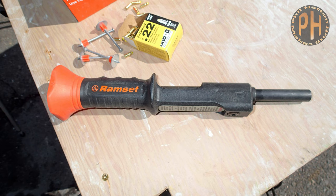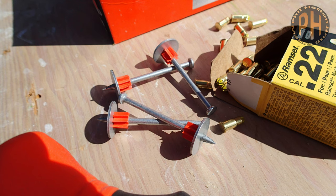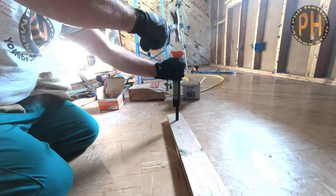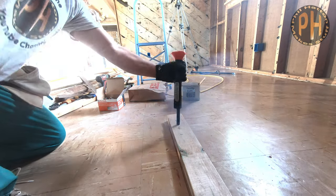I bought one that is triggered by hitting it with a hammer, and I had to get over the flinch factor in order to hit the trigger squarely so it would fire. It's weird that the fact that it goes bang when you hit it makes me a little less likely to hit it than a chisel, which is almost exactly the same action. There are other powder-actuated nailers that have a finger trigger. You might consider spending the extra dough if you have a big project.